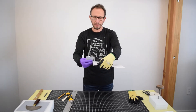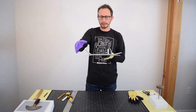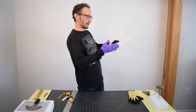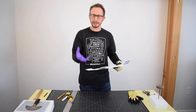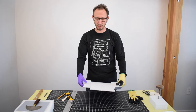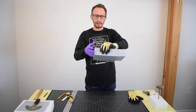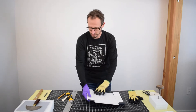So I've cut those independent flaps, and now you can see as I bend those up, you get this kind of U-shape with the box. What I need to do now is cut these little slivers off of each of these flaps. As it's facing me, it's a V-shape — these flaps all have a V-shape to them. It's for aesthetic reasons as well as functional. If the box were to slide across the ground, when I go to fold this up, these sides can actually be proud of the bottom or the top, and that can cause a box to catch on something and flip over.